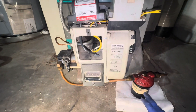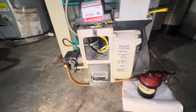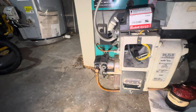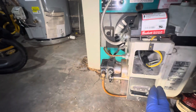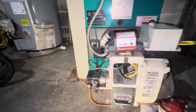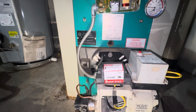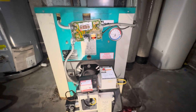One way to troubleshoot this system is to make sure the oil filter is clean and make sure the oil tank is more than 25 percent of the total tank charge, to create some pressure so the oil can run by gravity, come down here, and when the solenoid opens it gets in, and with the spark creates the flame. The blower motor is there to push out the flame and push the flame into the heat exchanger, which heats up the water.